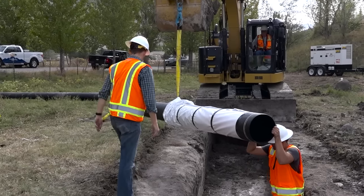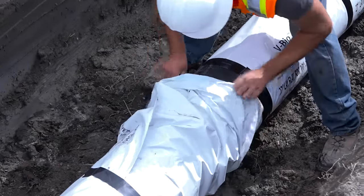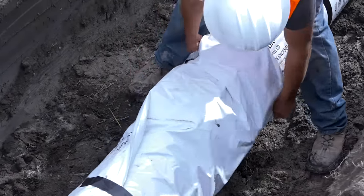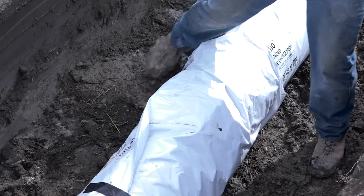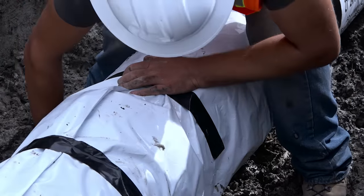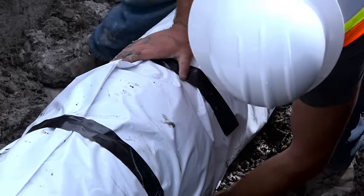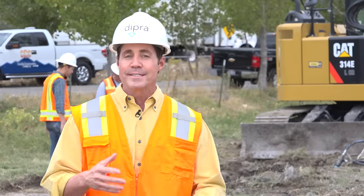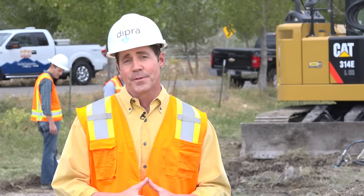Lower the pipe into the trench and make up the pipe joint, pulling the overlapping portion of V-Bio from the previous section onto the new section. This should result in approximately 1 foot of overlap on top of the film already taped to the length of pipe being installed. Fold over the overlapping portion of V-Bio from the previous section and, taking advantage of the bell hole, tape it down with a length of tape around the entire circumference of the pipe.